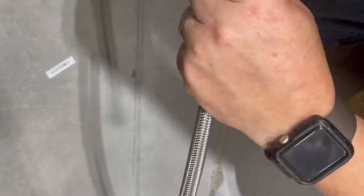Here's where this comes in. This particular adapter is three-quarter female garden hose thread by half-inch male iron pipe, and that threads on very nicely.